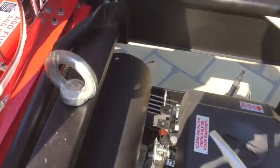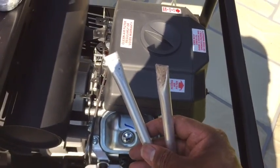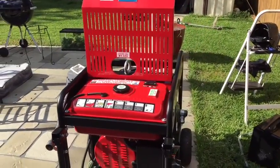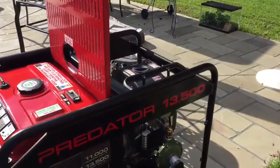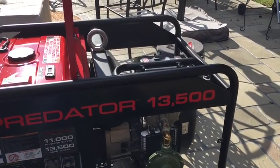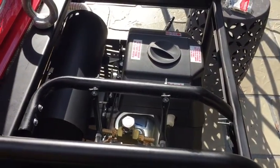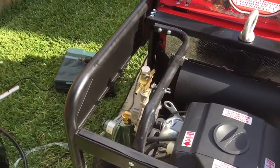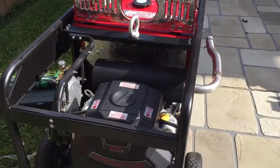I made up these two spacers to use with the mounts and clamp it all together — you can see kind of what it looks like. Spent most of the day doing the mods needed to get it on propane and to route the exhaust so I can run it inside my quiet shed. The propane regulator is now tucked inside the frame. I took some tubing and formed it as a brace across the top of the frame, then suspended the regulators from that. Since it's on the frame and not on the engine, there's no vibration at all.